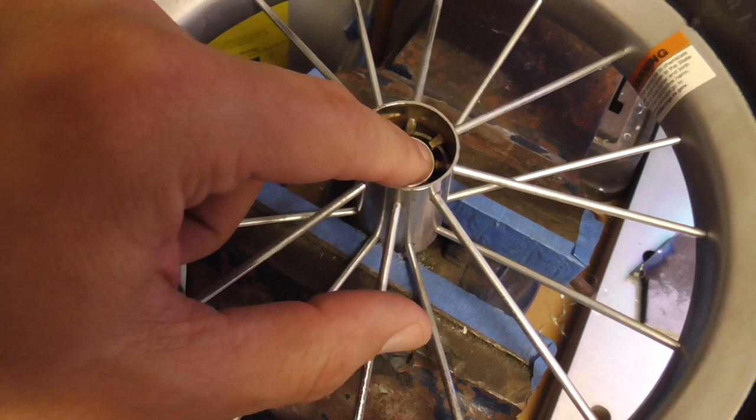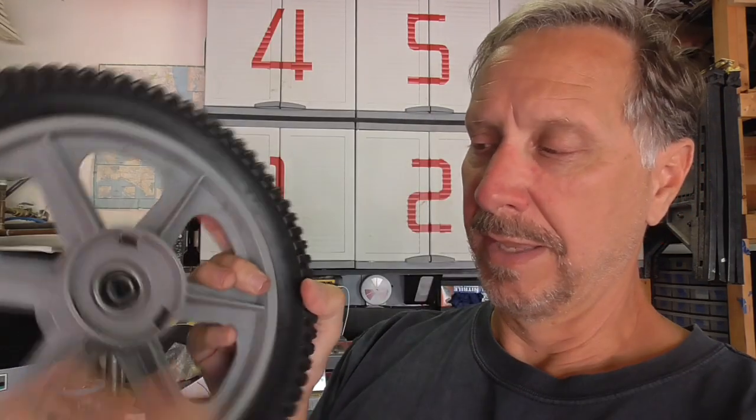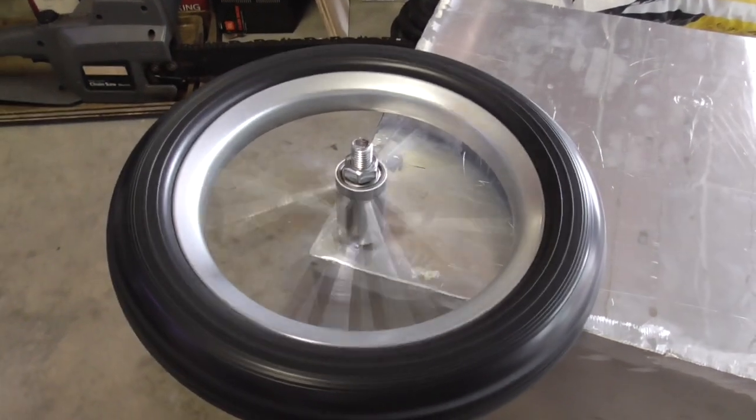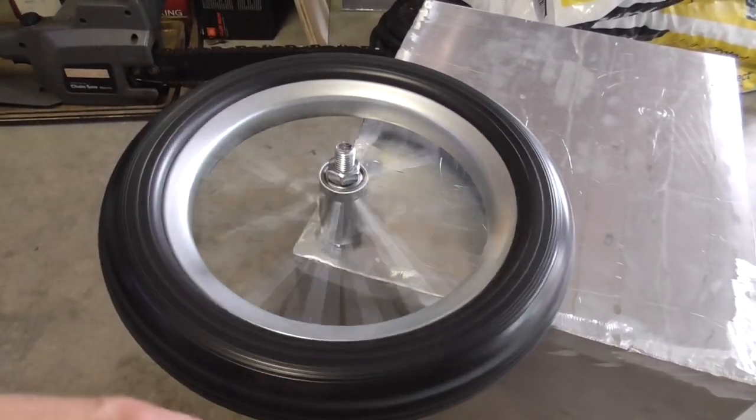I can show you clips of what was going on. What I needed was either to attach it with stoppers on each side — just tight enough to keep the wheel from wobbling too much but no tighter — or I needed a way to brace between the two inner races so that when they push together there's support and they won't destroy the bearings. That's what I opted for. Later on the other wheel, I just made the shaft longer and used two nuts — one tightening the other in place — to create stoppers. That seems to have solved the problem. I cranked down on the nut pretty good and the wheel still turns.